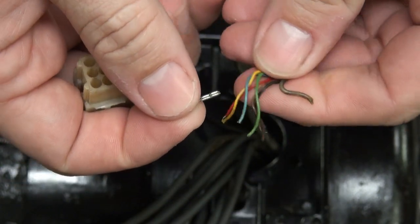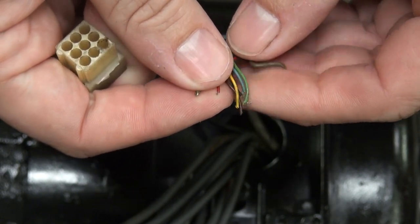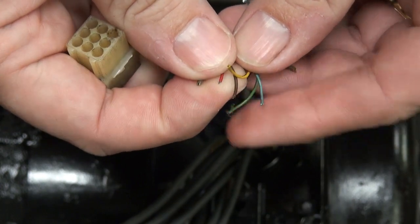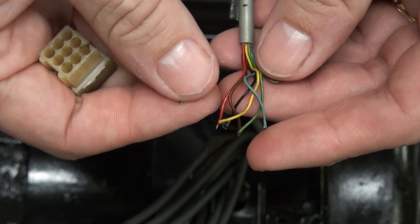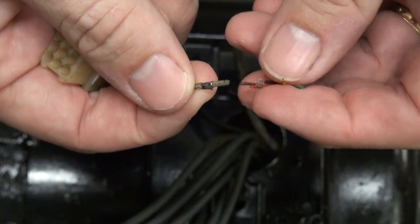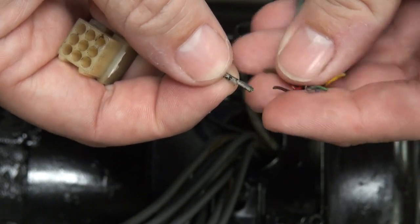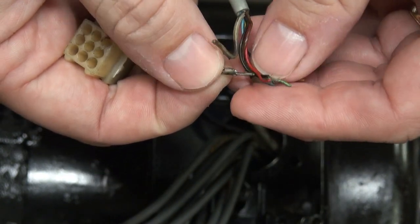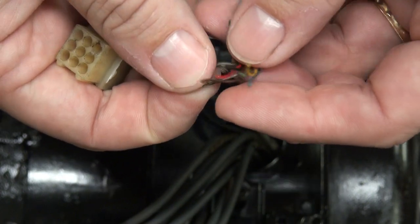While a lot of people are very good at machine maintenance and repair, I unfortunately see a lot of bad electrical repairs, and this is another example. One of these pins — the wire must have broke off — so they just tried to solder onto the back of the pin and made a cold solder joint that wasn't really attached. Luckily it was just the shield, so it didn't have a horrible detrimental effect, but it wasn't good.